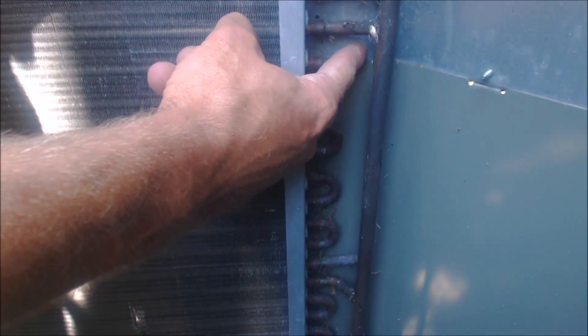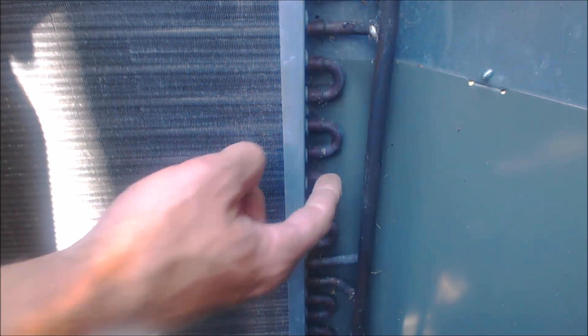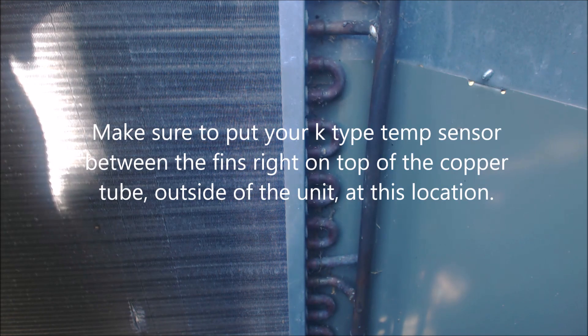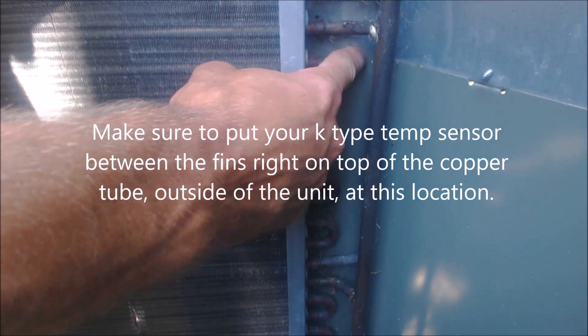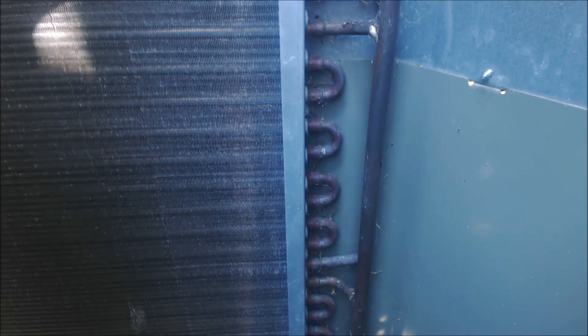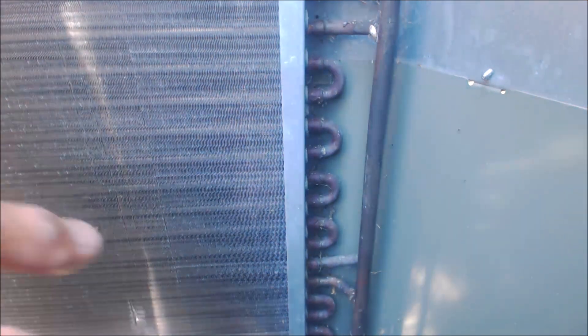You see this metal right here — you just look right outside and take a measurement. We can see that's about four inches or so. So we're going to go outside and put our temp probe into the condenser fins about four inches lower than where this metal starts. There's always some type of sign where you can figure out where the saturated state is. On this coil there are actually three sets of saturated states.